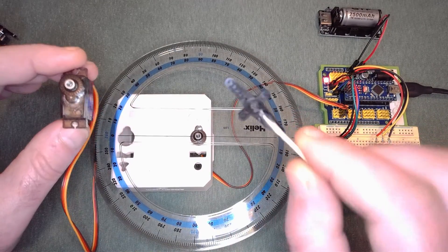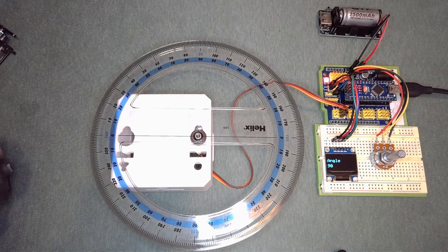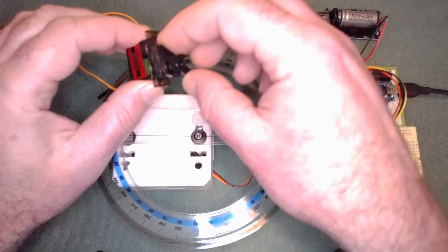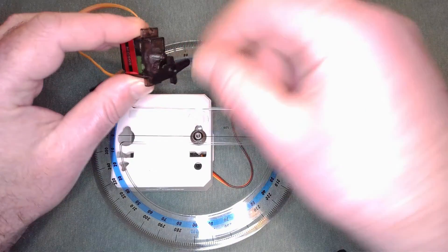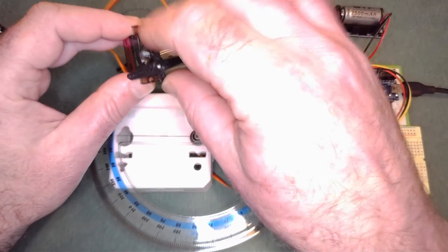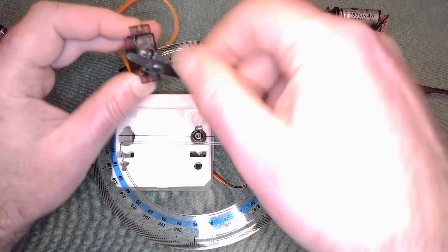This is going to cause a problem with Otto immediately. You also need to be careful with the metal gear servos you buy. This one has a physical stop inside — a little dimple on one of the gears. When it reaches full lock in one direction it hits the gearing underneath and stops, and similarly in the other direction, giving you well over 180 degrees.